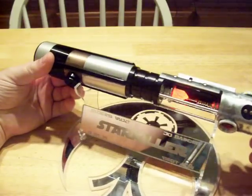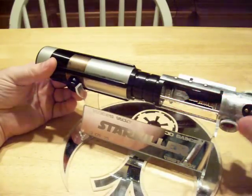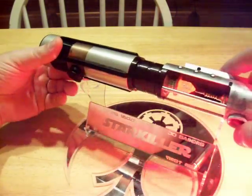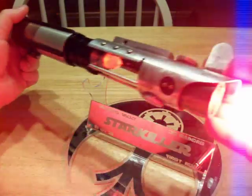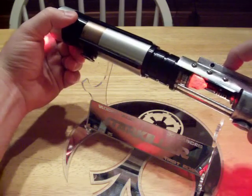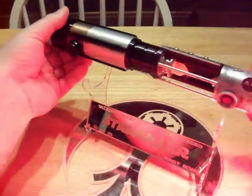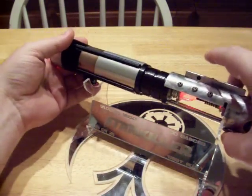It's a Starkiller — the Force Unleashed Remastered by Nightstorm. As you can see, this is a program that will just do that slow pulse and then it goes into the idle configuration where it will just blink as per the config files. That is set up to mirror the Luxeon when the saber is on, so it flashes the same as the main LED. And when you go into lockup, it mirrors the speaker. All those features are adjustable and you can actually adjust them in each sound font — it's actually pretty neat.